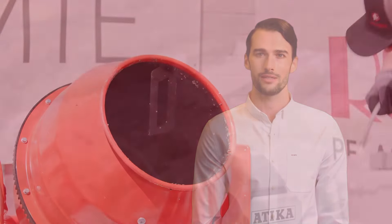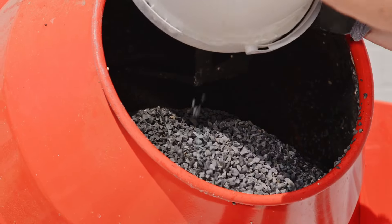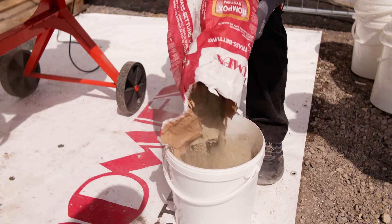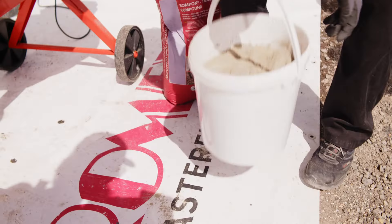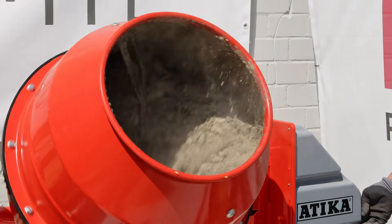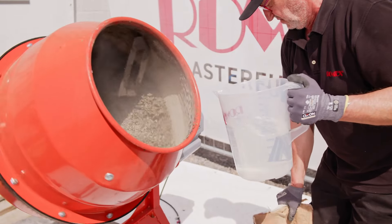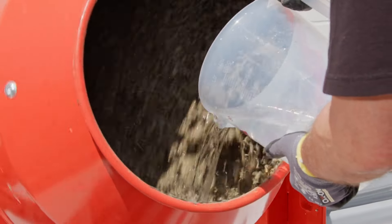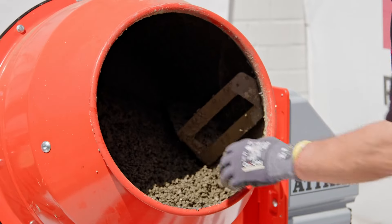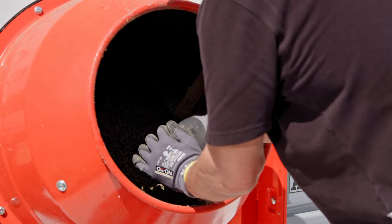To prepare Romex Trass Bedding, mix approximately 10 liters of cold water per 25-kilo (55-pound) bag of trass compound with equivalent parts of quarter-of-an-inch clean aggregate in a clean vessel using a mixer for three to four minutes. The mix should be slightly moist, similar to damp earth, and ready for immediate use. The correct consistency is achieved when the mixture can be formed into a compact ball with a slight sheen.